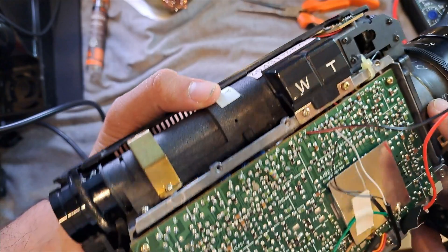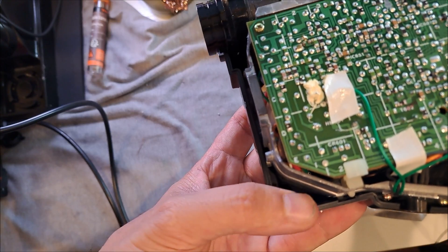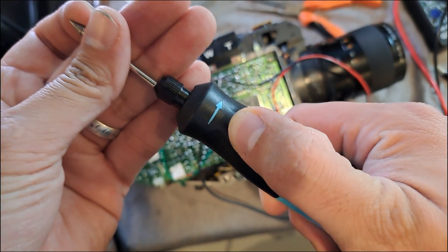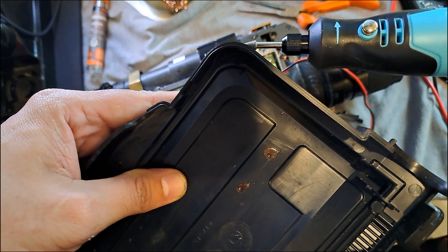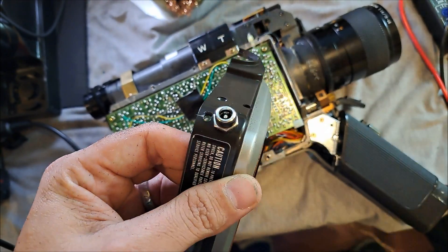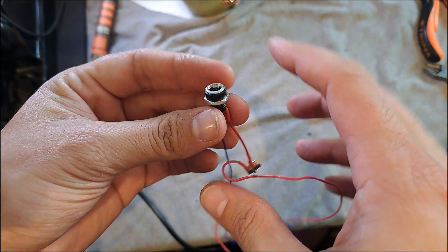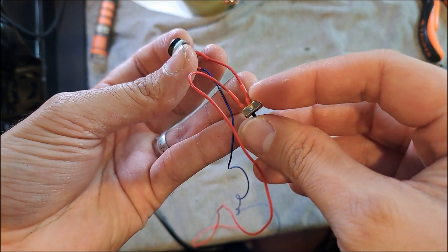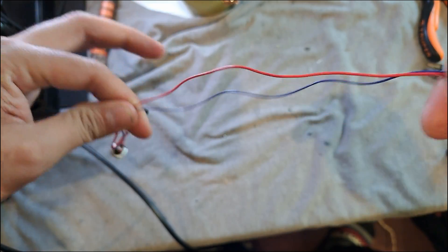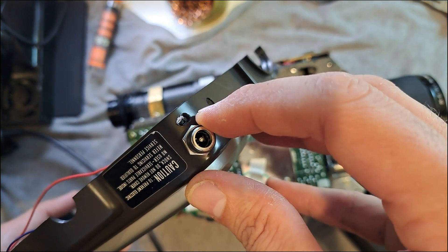Now I need to find a good place to install the final connectors. This hollow place inside the camera seems right — I think it's the best option to drill a hole and install the connectors. I'll be using this small drill. This is the hole I drilled where the battery connector fits perfectly. I also made another small hole to install an on/off switch. I've soldered the connection between the battery connector and the power switch, so only two wires remain, which will be soldered to the camera's motherboard: the red one to the power input, and the blue one to ground. I glued the connector to the camera's casing — looks nice and clean.